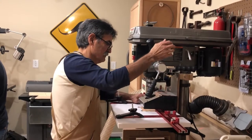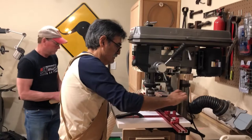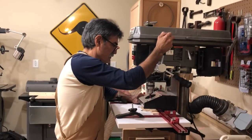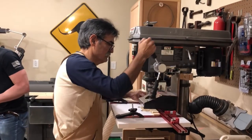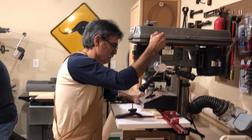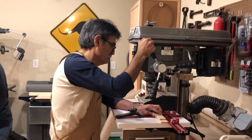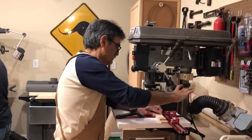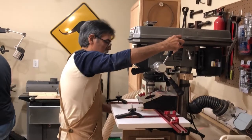Just drilling 4 holes for each of the tops. And remember that there are 50 tops and 50 bottoms, and you had to do 4 holes for each one. And then it was the same thing with the rabbets. And then as you saw on the frame structure for the side rails, each one of those had to be cut down from 1.5 inches at the top of the side rail to 1 inch at the bottom. So just be prepared if you're going to do this, that that's what you're going to face. Here we go.